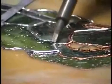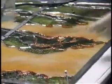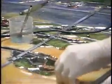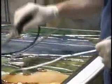Okay, going along here. One thing, I'll show you a little bit of a tip that somebody showed me at one time. These spools of solder eventually run out, and you're left with a length of solder like this, which if you go through and use this up, you're left with a very teeny tiny little bit that's too hot to hold. You could use a pair of pliers to hold it, but that just doesn't really quite get it. So a nice thing to do is to take the old solder and just solder it to the new solder, so that now you have no problem with holding that short little remains from the solder spool.